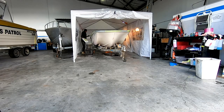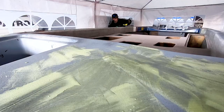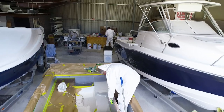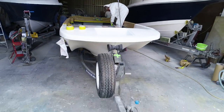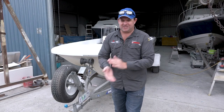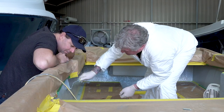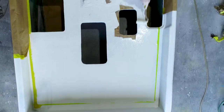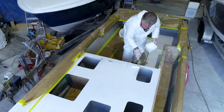To speed things up, I've called in the cavalry. I've employed a man to fair up and paint the deck, and the result is great. The painting of the deck was a process — it took my man the best part of three to four days to bog it, sand it, bog it, sand it, and finally paint it. I brought it to a fiberglass factory. It's going to cost me money, but I'm going to get it finished. That finishing involved flow coat — it's the final layer and is rolled on nice and thick and gives a much more polished look.